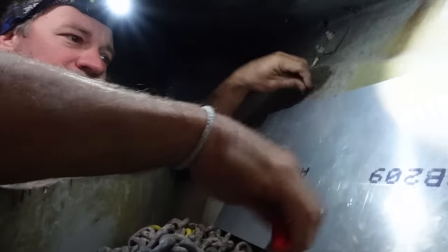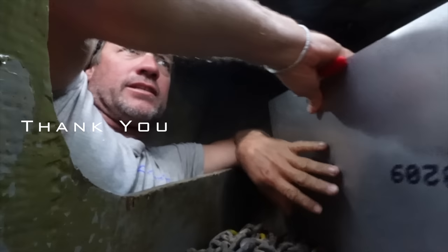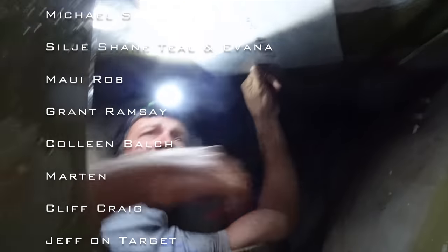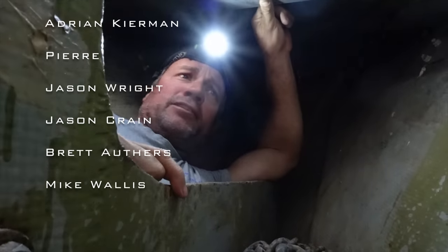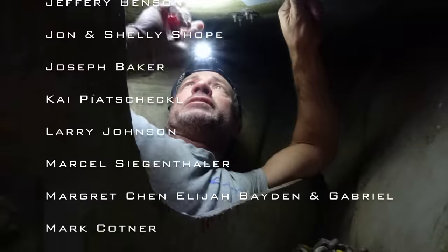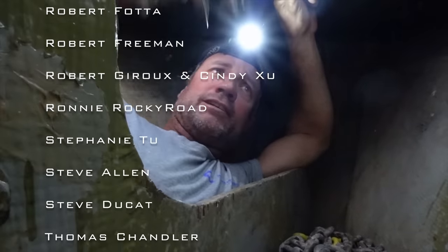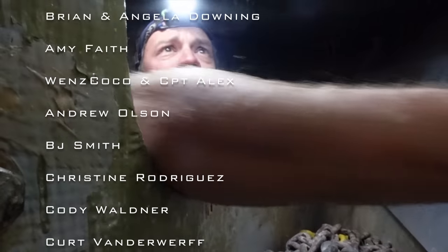I've just gone and bought a backing plate. So I'm going to cut this out and then we can remount the windlass. So we'll get a plate up over here. Never had one in here before, so I'll re-drill some holes in this fella. We won't rip a hole in our foredeck if we're ever anchored in 50 knots of wind with big seas. We can take a lot of pressure in this point. Otherwise, we're just relying on the glass to hold the bolts that was originally. I don't know, I like the idea of a backing plate. So, for what it's worth, we're getting a backing plate.